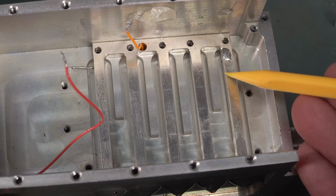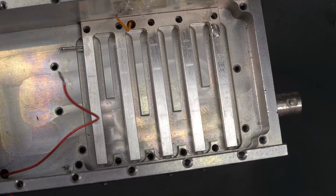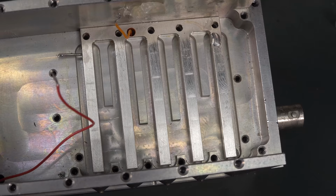And it looks like there's another one under there, is there? I can't see any other reason for these shorties here. Wow, I wouldn't expect a 5-stage cavity filter in something like this. I thought it was a fairly simplistic application, but maybe they need this to get the discrimination required. So, on the transmit side or the receive side? I assume it's the receive side.